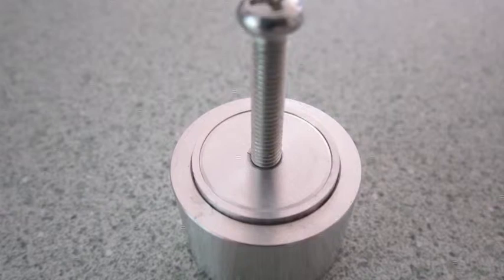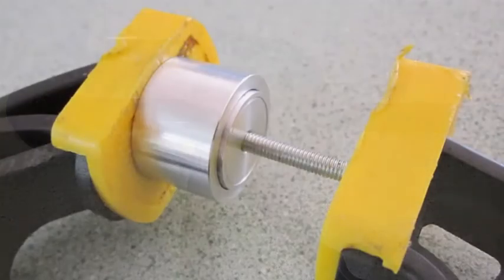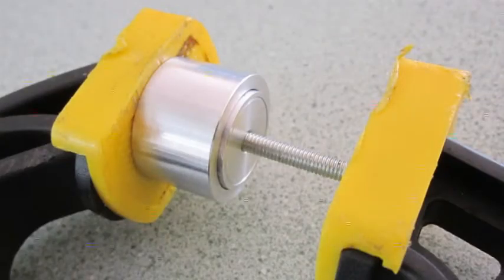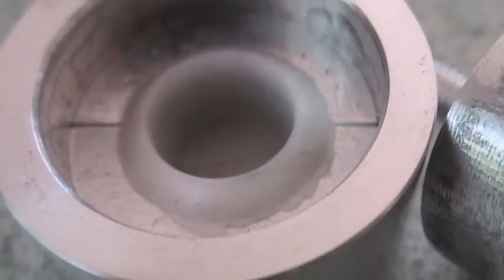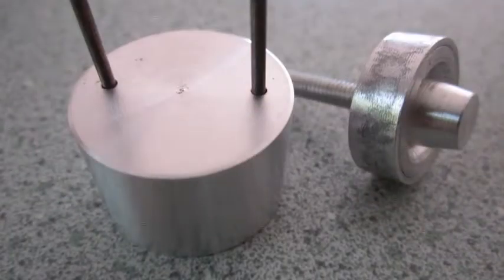Align the top die to the tube and push it in by hand. Slide the assembly into the opened clamp. Clamp it tight. This is injecting the plastic all over the die surface. This is the first foray into thermoplastic injection moulding. You can loosen it and twist the top die to smooth the top spear locking lip if required. Reclamp. Allow it to cool and pull out the top die.